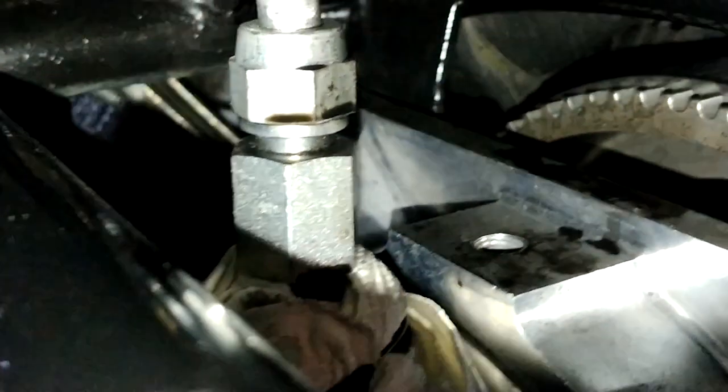And I'm like, how is oil getting up onto there and then running down? So I was trying to figure it out. And I think what was happening was the oil was leaking past the O-ring under high pressure and it was kind of vaporizing. And then with the air rushing around in the cowling here, there was oil just sort of vaporizing everywhere, and then ultimately it was just getting on everything and collecting in those places. So anyway, more on that in a little bit.